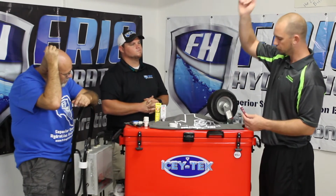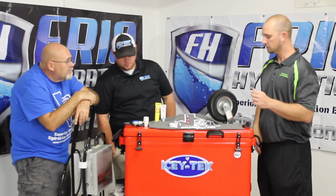We recommend blue because if you do need to make a repair on something and get it taken apart again, the blue will hold it and keep your lock nuts or bolts or what have you from backing off, keep them from falling out, and you can make your repairs if need be. Number one place I could see this being useful is on the old water boys that I have, the uprights, those set screws, the Allen screws, the ones that fit inside. They always come undone. Those things are always getting pulled off and loose and getting cockeyed. So it'd be a great use for Loctite. Again, Rob recommends blue in case you need to make a repair or take it apart at some time in the future.